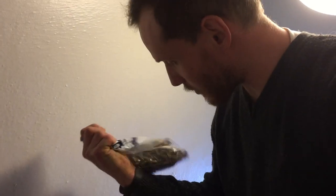Okay, I'm up on top of the world here now. I got some of these 3.5-inch screws here. Just gonna screw them through the face of these boards down into the joists.